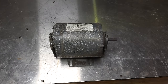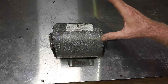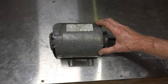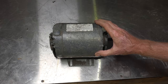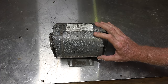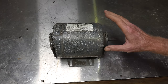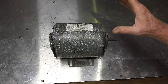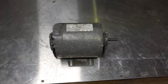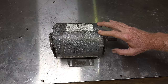What is centrifugal start? It's a method of getting the motor started by engaging the start winding with full voltage — it's a lot out of phase from the main winding, so it gives it a kick. With the start winding sized properly for the load, you turn that on, the motor starts, gets up to 75% speed, and then it shuts off the start winding.